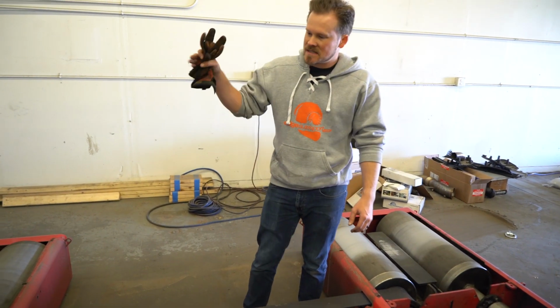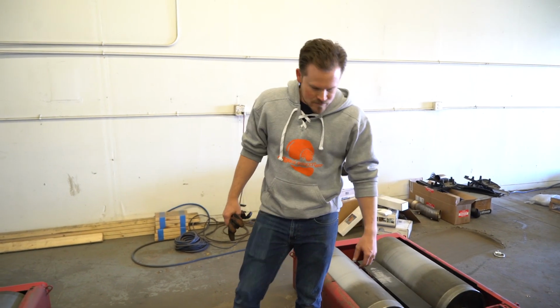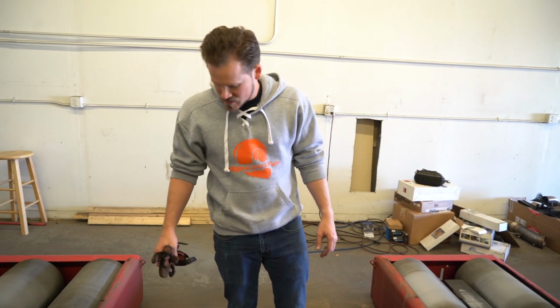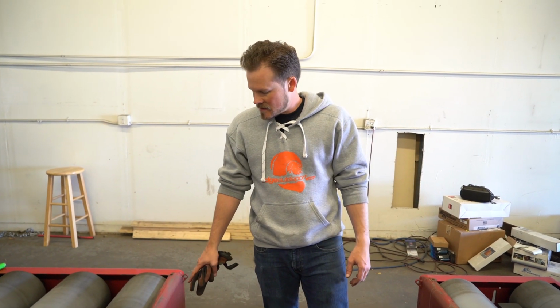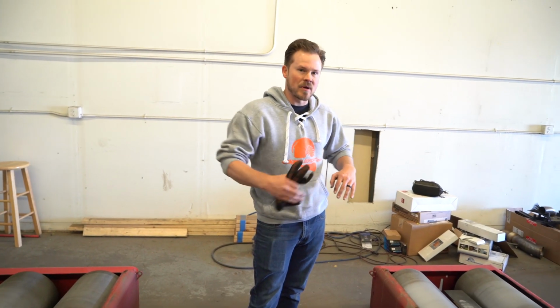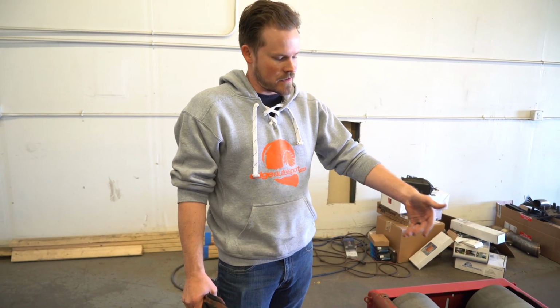And to do that, we've got studs underneath that are anchoring both sides down. Gotta loosen those. These connecting rods, whatever you want to call them, tension rods I think is what they're called. We loosen those, the two halves will slide together a little bit. We'll be able to get those out of the way, and then there should be enough slack in the belt that we can get this roller lifted up a little bit and get the belt off. If not, we'll bring the forklift in to lift this section up and move it closer and make it a lot easier. That's basically what we got to do to get the two halves separated.